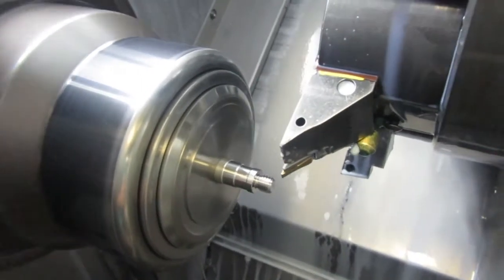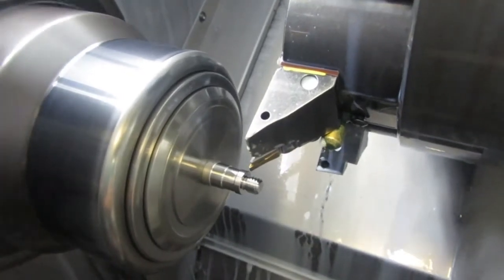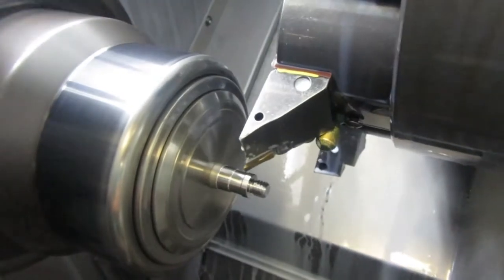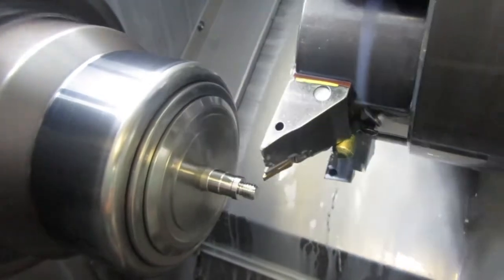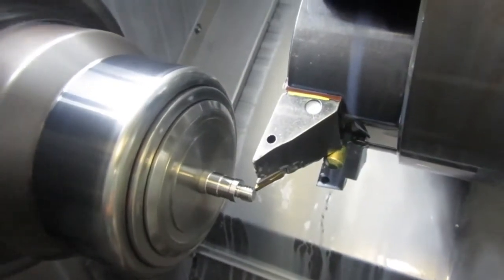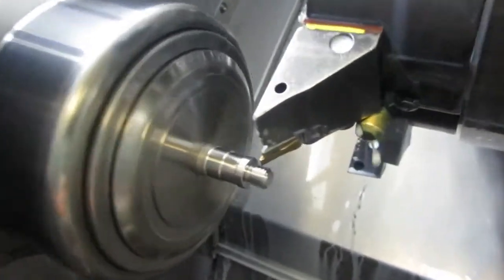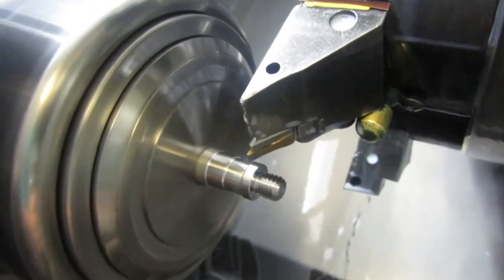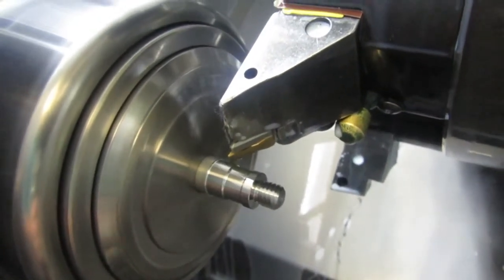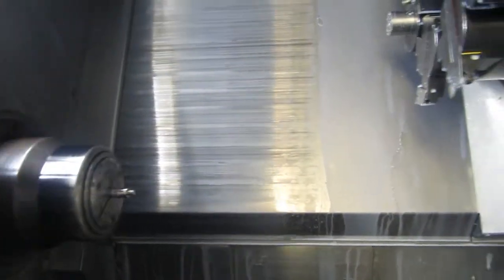It kind of rubs all that material out. Like I said, there's not much coming out of there. Let me get that little groove - got that little groove back there. So there's no deburr in this, it has chamfers everywhere. Once it comes off the machine it's pretty much ready to go. And here's the final pass right there. Let's go to threading - make sure the coolant is off. Okay, let's go to threading.